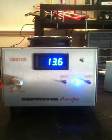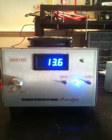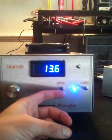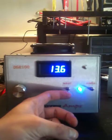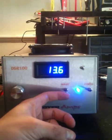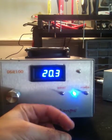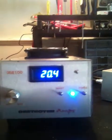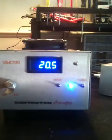But if you get to the point where you're drawing so much current that the voltage is actually falling down, I've built in a boost circuit. What this boost circuit does is allow maximum amperage and maximum volts — basically maxing the whole transformer out completely. So just in case you're running some high-powered stuff and need to squeeze every last bit out of it, this power supply will take it. Click the boost — boom — there we go, we're at 20.4 volts. With load, you'll probably see it drop to about 19 volts. We're talking almost maximum 100-amp continuous altogether.